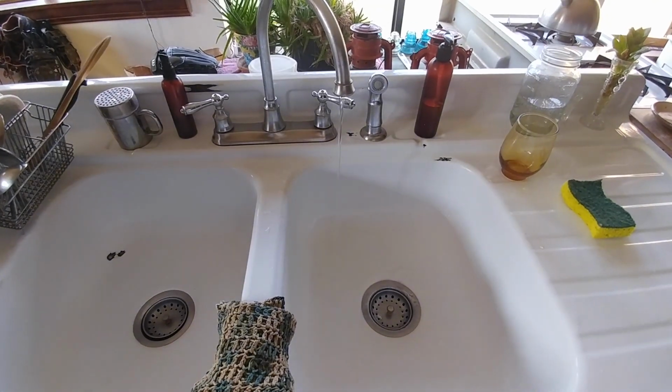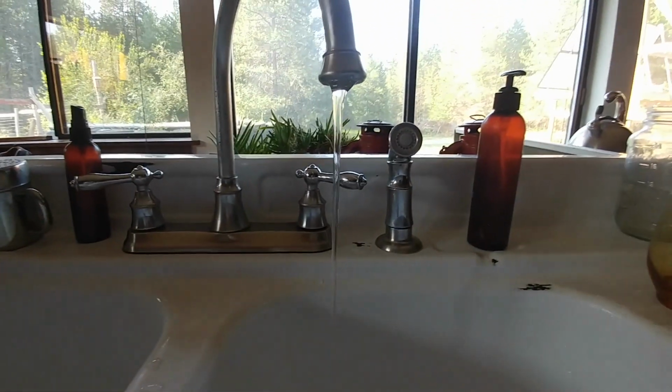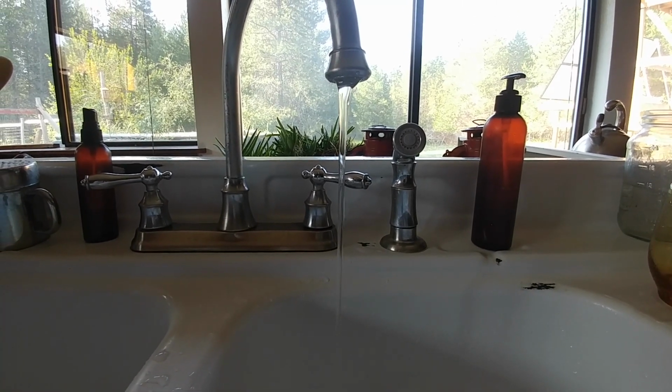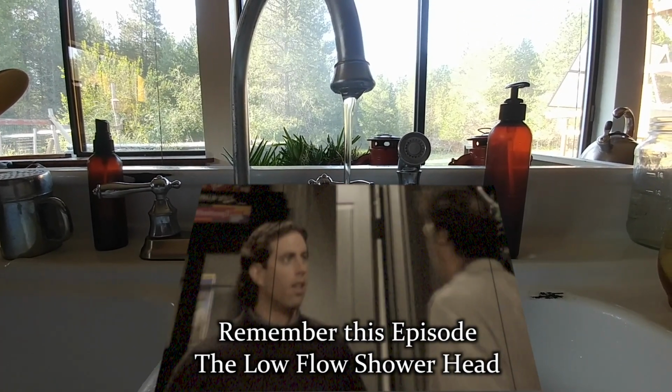I replumbed a new pump into the system. I used a submersible. Everything's working. I got it all set up. I turn on the submersible. The submersible is AC, so I had to rewire from my DC pump to AC. And literally, the submersible water pump came on, started pressurizing the system, but it could only pressurize to 10 psi. That's not enough pressure to take a shower. That's really low flow. That's terrible. You turn on the faucet, it's like a trickle.